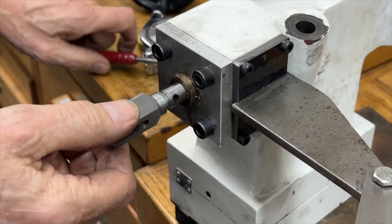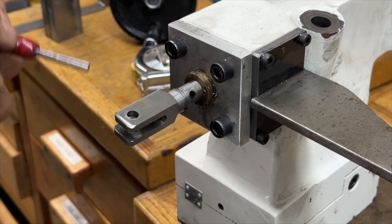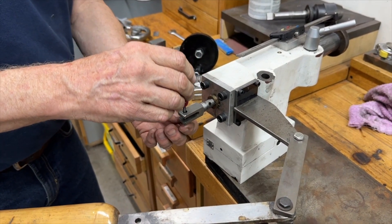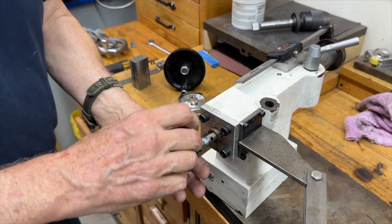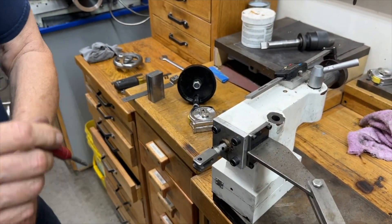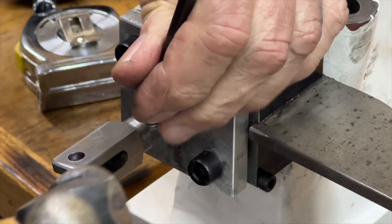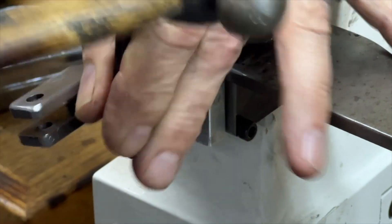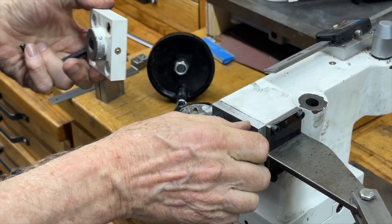I had to make this rod — I'll take it out to show you. You have the fork here to fit the quarter inch slot and a pin hole. Originally it had a bolt in there, but you probably want one of these pins because what happens is you lose it if you don't keep it where you can see it, and without it the mechanism doesn't work. These are metric bolts — it's the original bolt pattern that was already in there, so you don't have to re-tap those holes. I used the original plate as a pattern to put the bolt holes in.